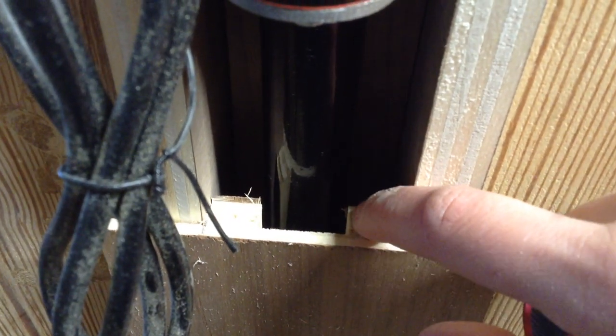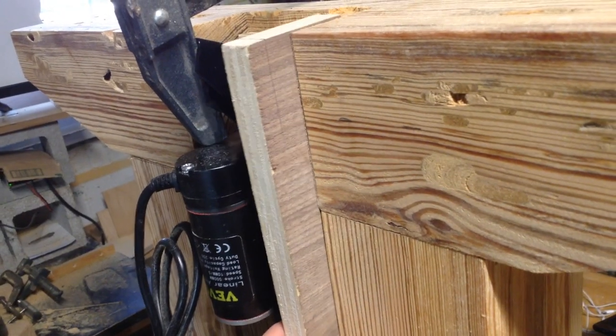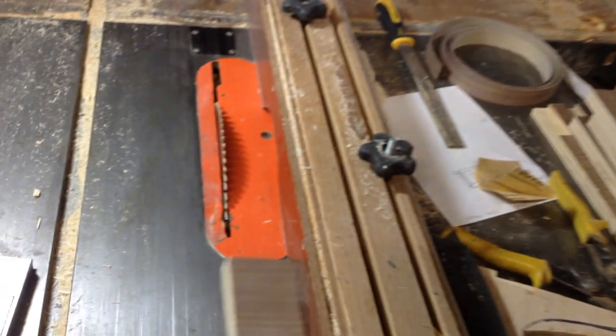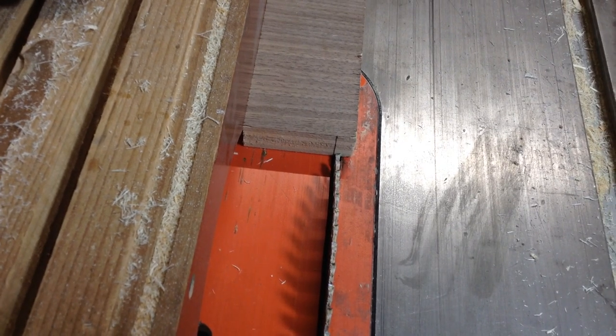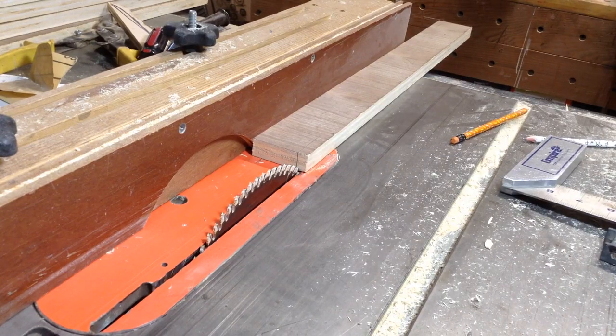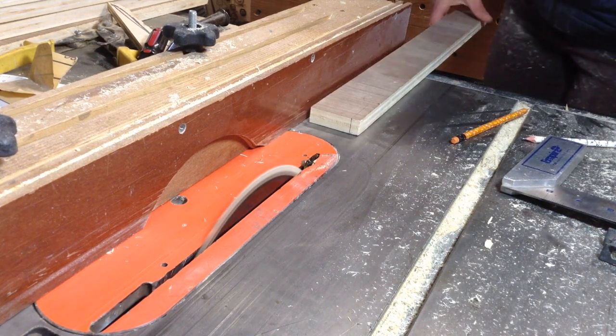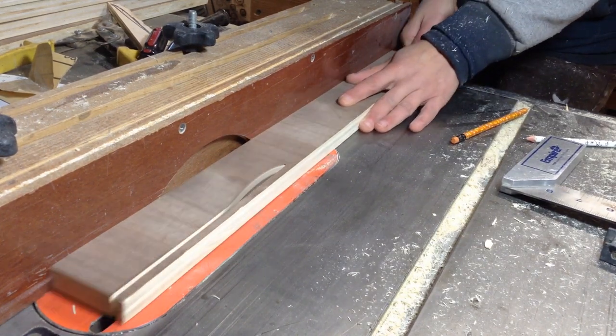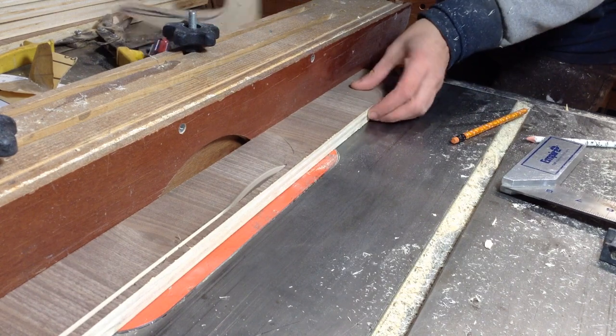With this in place the actuator now has clearance in the front. I cut more of the sides so they're not as thick of a flange — I wanted a pretty low profile. My sides were still a little too thick, so I tested my mark on both pieces to make sure I could cut all sides to the same thickness, removing a little less than three-sixteenths of an inch so the front part is as close to the front edge of that trestle as possible. I left about a sixteenth-inch gap to account for potential seasonal movement.